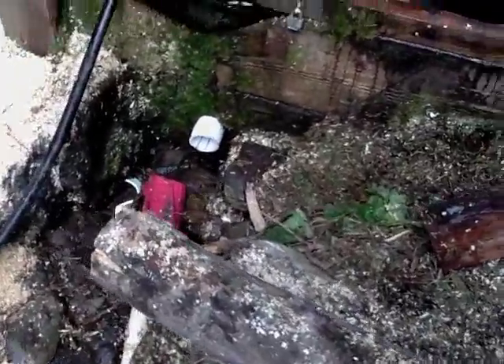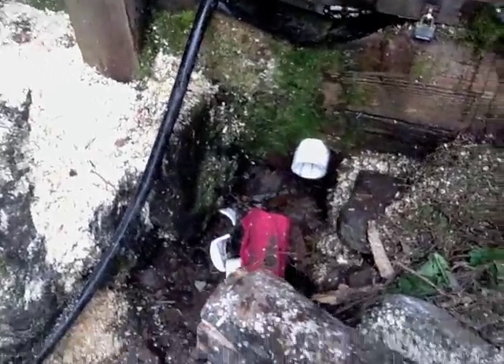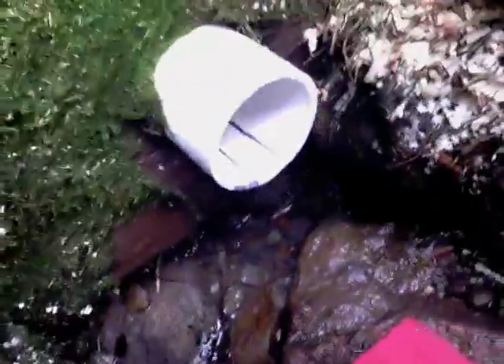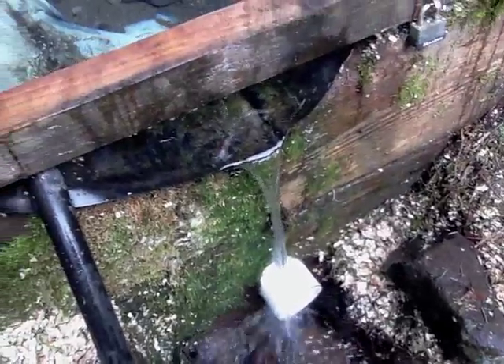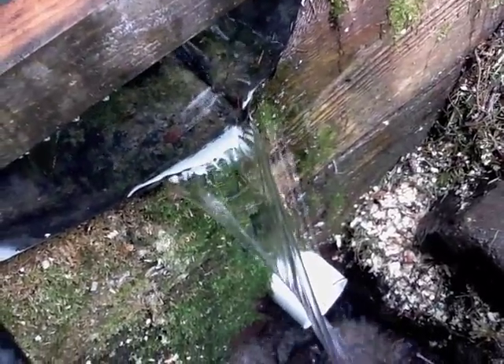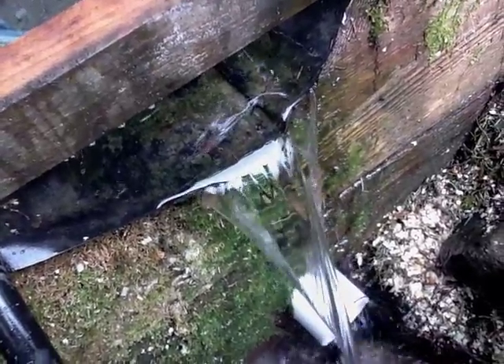Okay, so we've completed the process of putting this new drain in there. You can see that the rubber is held on by a stainless steel clamp. I've got it closed right now to make sure it's a good seal. You can see it's not actually leaking at all. As the water builds up it's going to come up over the top and start draining out over the top. So here's the water draining over the top, and the consequence of that is it's going to take all the stuff floating on top and clean it right out through the slot here. It's also a good way to measure exactly how much water you're getting out of the spring, so you can calculate your power if you wanted to do it that way.